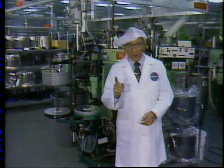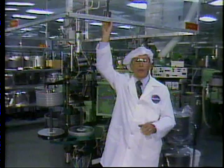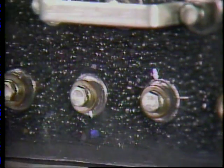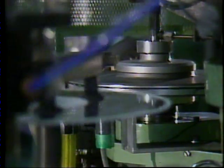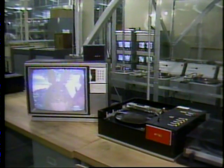This is the press room. Our stamper and its companion side are now producing one disc every 40 seconds. A shield helps create a controlled environment, with filtered air circulated down from the top through vents in the floor. The pellets which make up the disc material are automatically fed from the compounding room to this hopper, then formed into a shot and fed heated into the press for stamping. The pressed disc is then automatically cooled, trimmed, and spindled. Sampled discs are pulled regularly for quality control — special playback units measure signal-to-noise ratios, count defects, and rapid-scan the recorded program to evaluate overall quality.